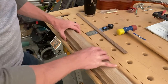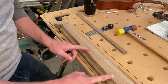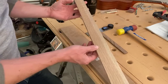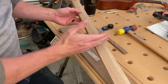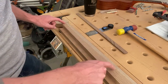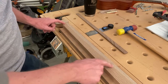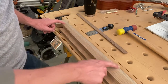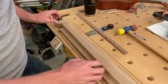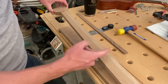There always has to be that awkward moment when you screw up — I forgot to cut the bottom nut. I cut all these different fret slots when I had everything nice and square, and now I've got this all tapered. If I just put this back in my miter box it's going to cut at an angle. So I'm going to find my center line, measure 15 inches dead on, make some parallel lines, and create a line perpendicular to those. But before you start trimming down your sides at a taper, make sure you cut your nut.